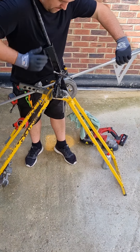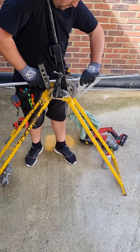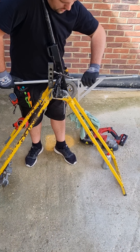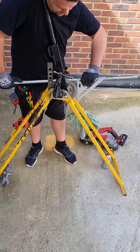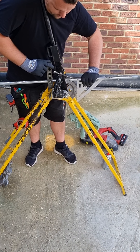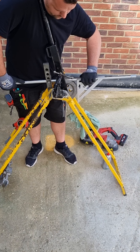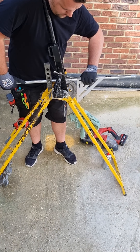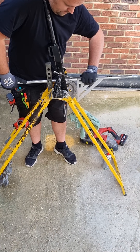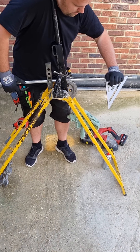So we're going to do our set square again, and again this way you can see the back of the former, the conduit on there — try to keep this in the same position. You can see that little bit of movement does have an effect, so do take that into account. We'll push the conduit forward so you're always going with the former, because that's the direction it will move when you go to bend. I'm happy with that — keep the right mark on the back.